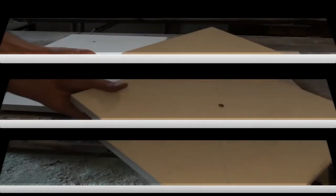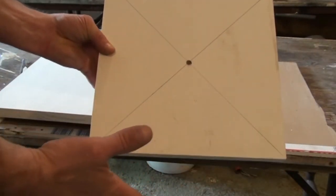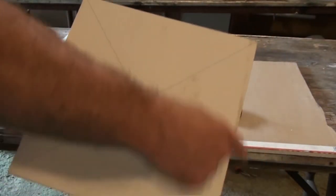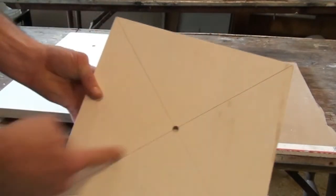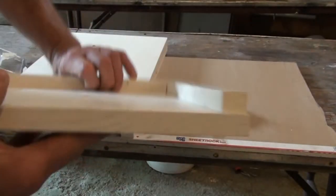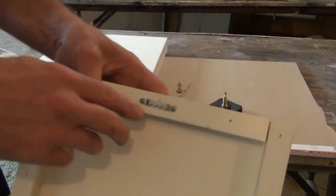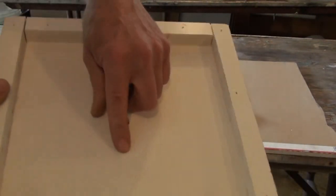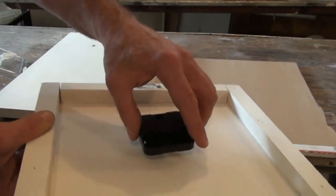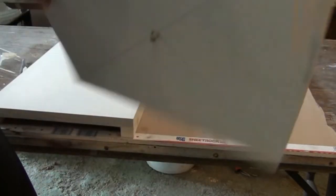A simple 1 by 12 — this one I actually made square. A 1 by 12 really isn't 1 by 12; it's 3 quarters by 11 and 3 eighths. So I made it 11 and 3 eighths square. I went from corner to corner to find center and drilled a 5/16th inch hole. I put edges around this, and there's the hook. When you take the clock works and put it in the 5/16th inch hole, we want it flush with the back so when we hang it on the wall, it's not sticking out.